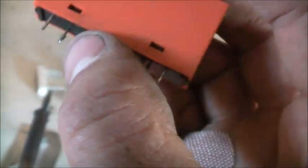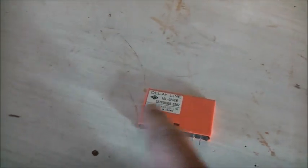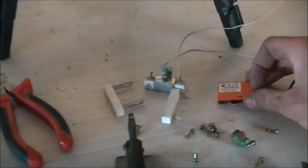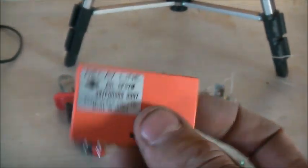Got the interesting parts off of that, like the delay line. They're very interesting devices, these. Dave at EEVblog did a detailed teardown of one of these. Basically, as he shows in the video, you've got a set of dots. A signal is sent down, bounces around, and the time it takes to get from one place to the other is the delay, a bit like a quartz timing something. It's used in PAL TV to get the sound to match the picture. Very cool, those. It's obviously made by Asahi Glass because it's a glass substrate with etching on it. Look up how delay lines work on EEVblog. Mike's Electric Stuff also did a video on one of these, delay line memory, using these to store some data, like a memory card.